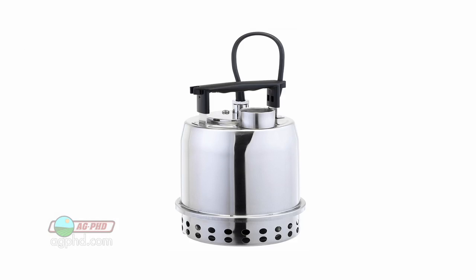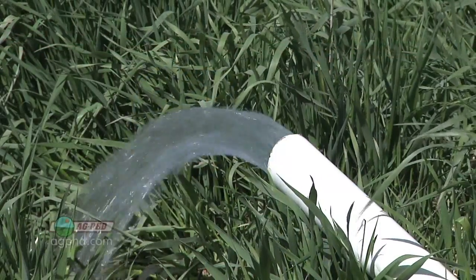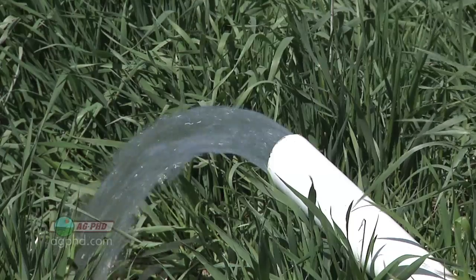You usually don't need a very large electric line because generally we're not talking enormously huge motors. Another way to cut down the size of a single pump is to have multiple pumps. Any lift station will typically have two pumps — that way if one shuts down, you're still running at half capacity. It also means you don't have to spend as much on one pump; two cheaper pumps can cover the total maximum flow needed.